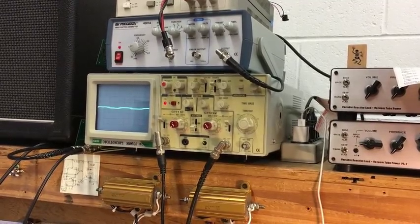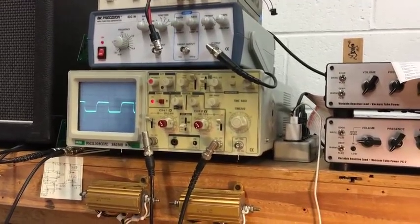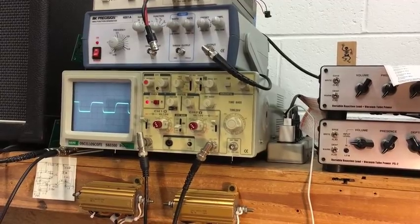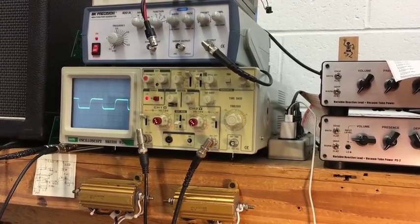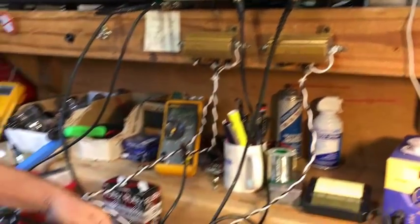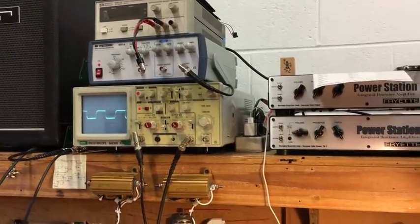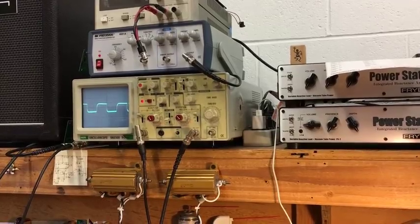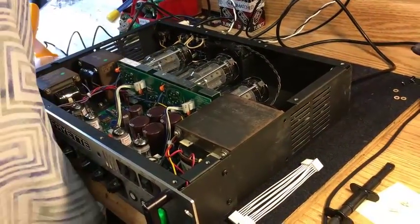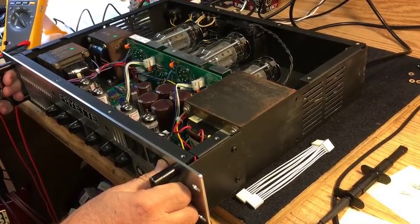The input level sensitivity switch in — that cuts the input level down — back. And the voicing switches in and out. We put a little bit of contact cleaner in the voicing switches and the level switches to make them operate more smoothly — that's all we needed to do. The pots are working great, everything is working great. It's running at full output. The impedance selectors are selecting — some people are going to freak out that we do this, but we actually flip the impedance selector switches under load because the transformers are made well enough that they can handle it. That's how we know the switches are working great. I did a pre-check on the bias, so I'll probably dial that in a little tiny bit, but otherwise we're done.